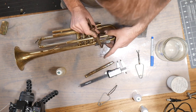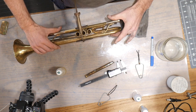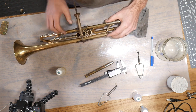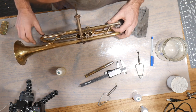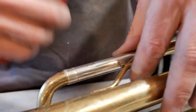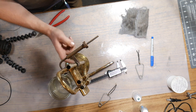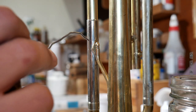I'm going to use this mounting jig here. One of the things that people make mistakes on is they will stretch or bend the metal around. What I've done already is bent the braces and made sure that everything touches where there's almost no pressure — everything just comes and sits right in there without having to bend or force the metal, because tension is what detracts from the sound. We've got our horn vertical so I can control where the solder flows up and down this brace instead of around it. I know I've got an entrance point for my solder right about there.